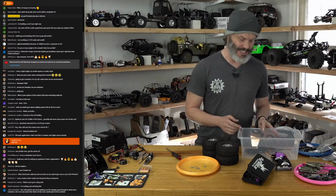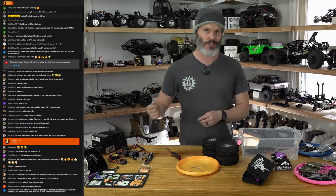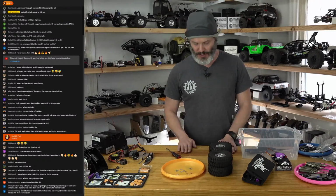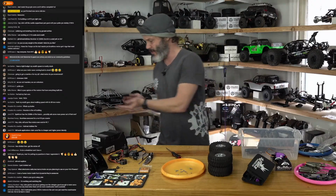It becomes really cost prohibitive to make that. If we could increase our diameter of motor, somewhere between 55 and 60 millimeters, we could do that in a single shot and not have to wind a whole bunch of stators or have a whole bunch of magnets for it. Then in that case, yes, I think axial flux would actually be a pretty good fit for our use, although lengthwise, it's really hard to beat radial flux.